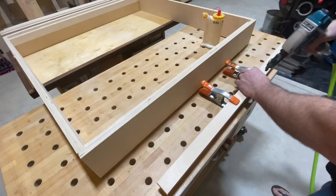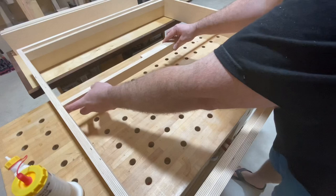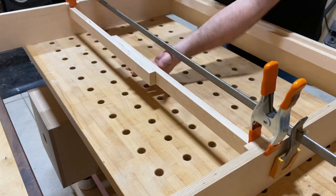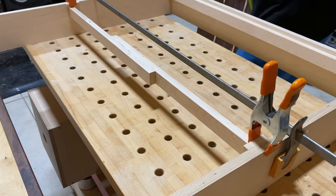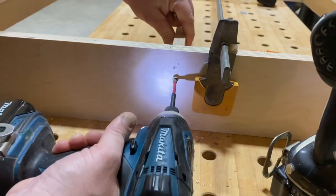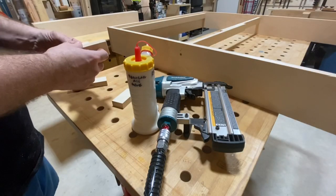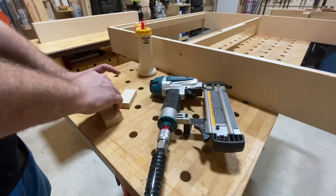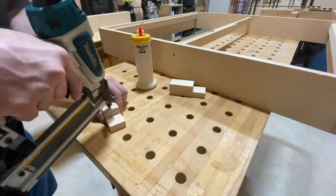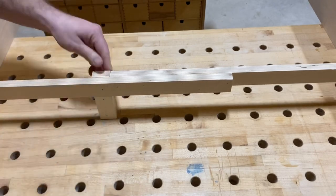Now I've got the stretcher piece that I need, and it actually comes into a benefit here — I have these doubled up right in the center and I'm going to use that to my advantage later on. To mount this middle support in place I'm using some half-inch pieces that are going to keep it just below the surface the thickness of the slats. This middle support piece is going to be glued and brad nailed, and then I'm also going to drive in a few screws too for a little extra added strength. To get that middle support piece to actually do its job and be supported, we're going to create some large rabbets by joining two pieces of plywood together with some glue and brads. There's no cutouts or nothing — you just glue these together and now you've got these really large rabbeted pieces that nestle in to where this middle support piece is joined together in the middle.